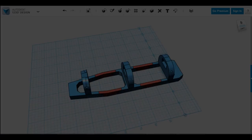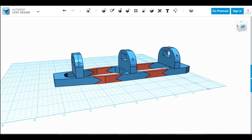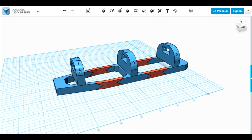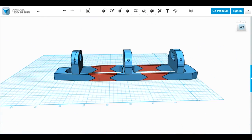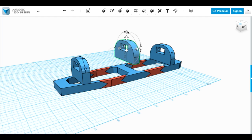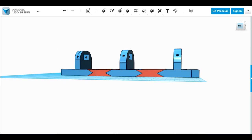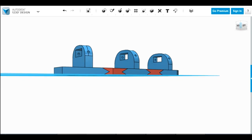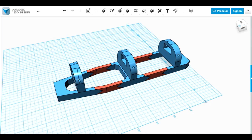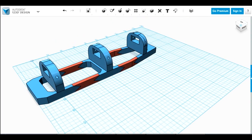Let's have a look at some CAD for these hands. Here is my design for one finger — these are going to be hybrid prints in Ninjaflex and ABS plastic. The red parts are flexible, printed with dual extruders and bonded together in one print, with the extruder switching nozzles on each layer to merge the materials. Essentially we've got two joints, with another at the base of each finger, and small pieces through which a Ninjaflex pull-string acts like a tendon. I've left holes for rollers if needed. This should make a jointed flexible finger with rigid parts in key places. We'll use this for two fingers, a wider scaled-up version for a third, and the thumb.